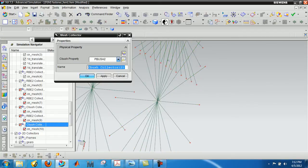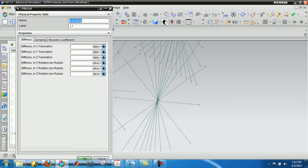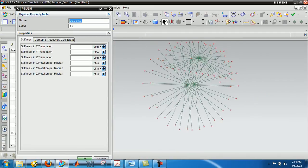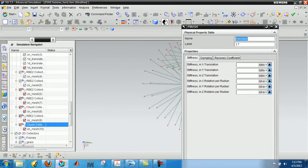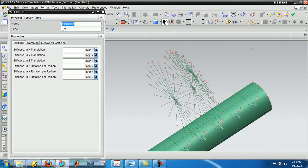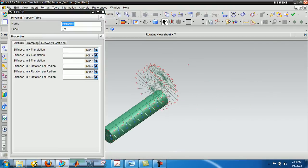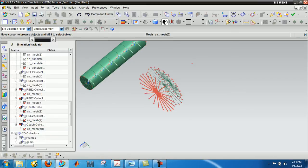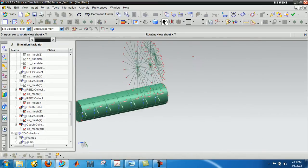Let's look at the C-bush properties. As I said, the C-bush can define stiffness in any degree of freedom. Here's a good quiz question: if I want rotation around the Z axis, what will my stiffnesses be? We talked last time about the difference between a stiffness of 1E8 versus zero. A quiz question may ask whether load will be transferred across a stiffness of zero or a stiffness of 1E8 — these are the conceptual questions to make sure everyone gets the big picture.